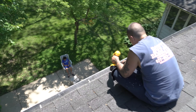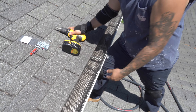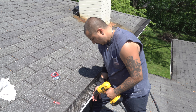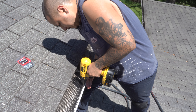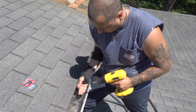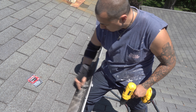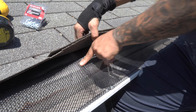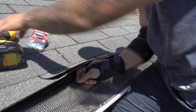At $2.80 a pop, I would highly recommend this product — it's very easy to install. So you can see David put these on already. I'm coming in here screwing them in. This is optional, you don't really have to, but if you have loose gutters, you come in, get your little screws — the ones that David showed you — and put them towards the edge where they're connected. Take your time doing it. You can put screws on both sides. This gutter's a little loose, so I'll flap this over and try to get the screw in right there. You can do it from up here or down here. With my knee, I'm pushing up the gutter right here. Once it gets it, it's nice in there.